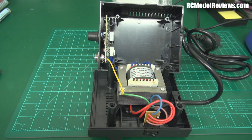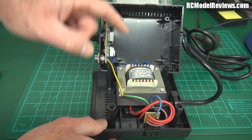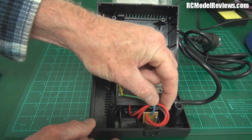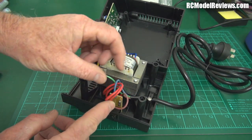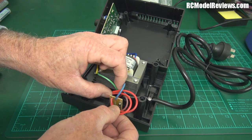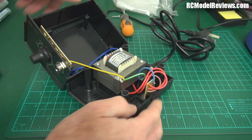Okay, you talked me into it — it wouldn't be a review without a teardown, would it? So here we go — this is what you get inside your cheap supply transformer; this will be different for each country. This is the 240-volt version. It's made to a price, people — don't forget that. The mains wiring coming in here goes straight onto the circuit, and I don't like that — it's already started to fray; that wire is almost off because there's no support for it.